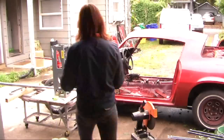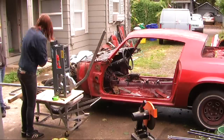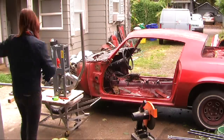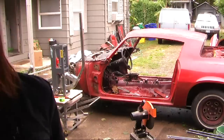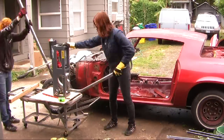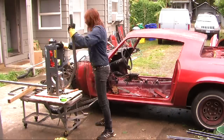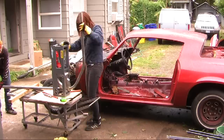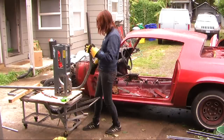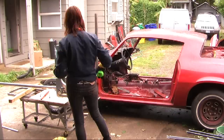Banging on it there, trying to get it in a plane so it's straight when it's bent. This is the bend that Trish is petering out on — that is the top. We're going to cross the top of the roll bar. Using some levels to make sure that the tubing is 90 degrees. I'm struggling with the tubing bender again. We tried oil, we tried everything. We finally figured out using a clamp works.